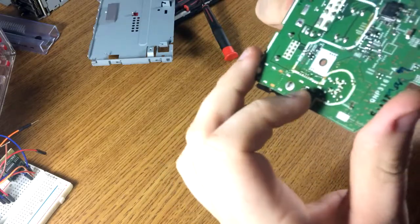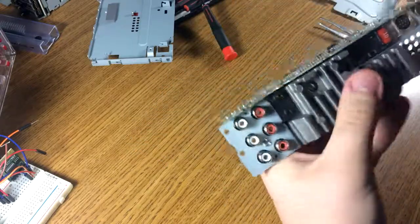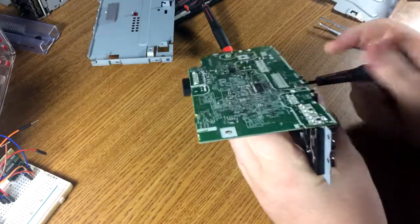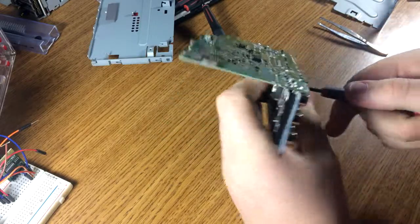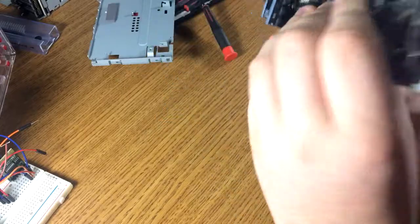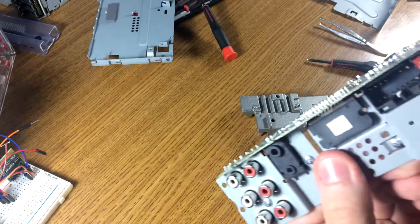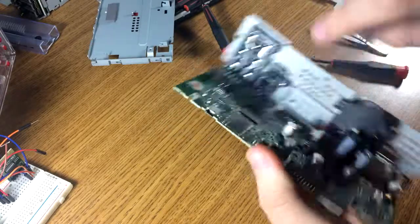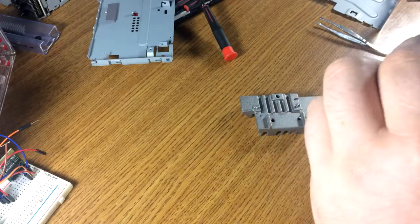I want to look at our plug and look for bad solder joints. I've got the iron heating up. I'm going to take off this clamp. I got tired of trying to get the solder off — they actually use that high-temp lead-free stuff through this entire unit. I've got my 40-watt iron turned all the way up and it's barely busting through. What I'm trying to do is flood it with normal 60-40 and suck it away. I ended up just bending the tab up.